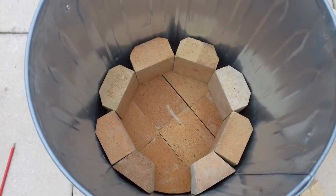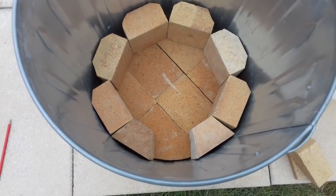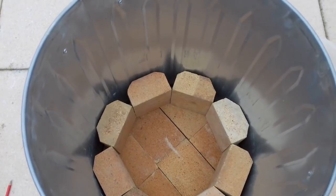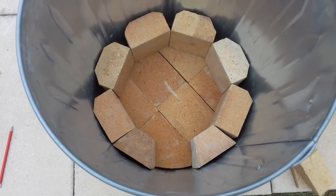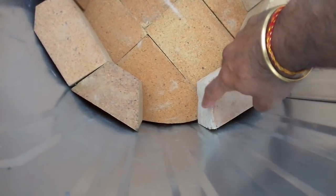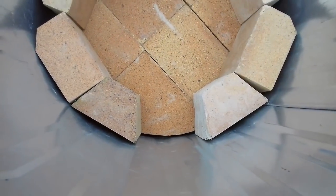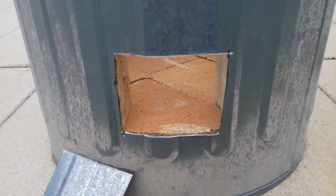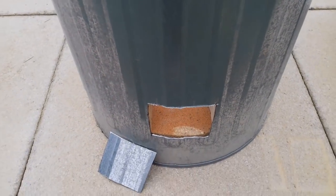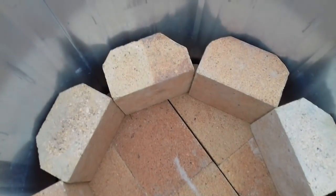So I've cut those bricks into halves and placed them in. When I put them in originally they weren't fitting that nicely, so I nicked the edges of them just so they would all fit in perfectly. I've made a channel here — I've cut these back so that here is where we're going to mark up and make our flue hole, air hole. That was pretty painless and straightforward with an angle grinder. We now have the flue hole, and that will supply plenty of air circulation when it's all up and running.